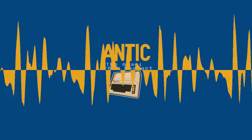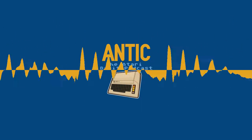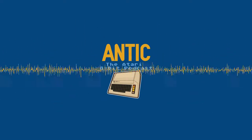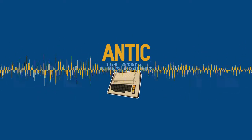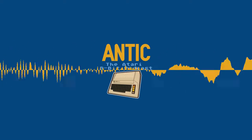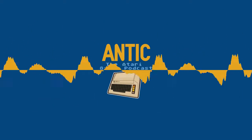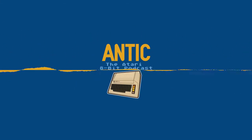'Another disadvantage is the requirement that the resistance of the transducer used be consistent with that of the game paddle it replaces. It is possible, without spending inordinate sums of money, to convert one of these home computers into a research-grade instrument with a resolution of 1 bit in 4096, if one knows a little about digital electronics. This article describes an interface for the Atari 800XL computer based on a 12-bit analog-to-digital converter.'